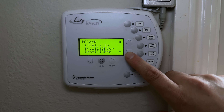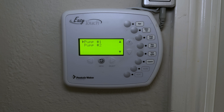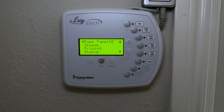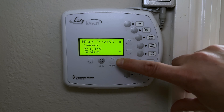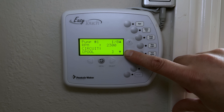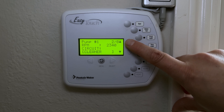Under Settings you can adjust the clock or the pump speed. I have two pump options, though only one is installed — Pump 1 is a VS (variable speed), meaning it can run at multiple speeds. This is usually configured by your pool builder, so don't adjust it unless you know what you're doing, as you need to move a sufficient volume of water through your filter daily. Here are my eight speed program numbers: number one is Pool Cleaner.